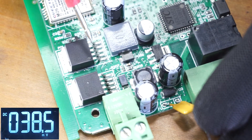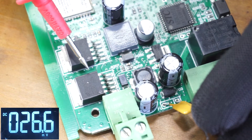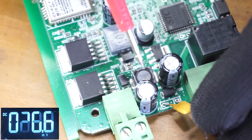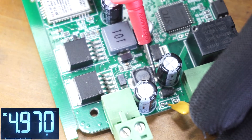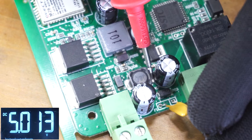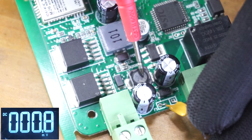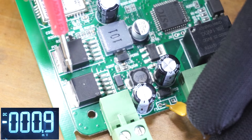Now let's check the output voltages of these two regulators. The output voltage of this regulator can be measured after the coil — in this case 12 volts, as you can see, so that regulator is good. If there is no voltage after this coil, it means you have a bad regulator and need to replace it, again making sure there is no short circuit.